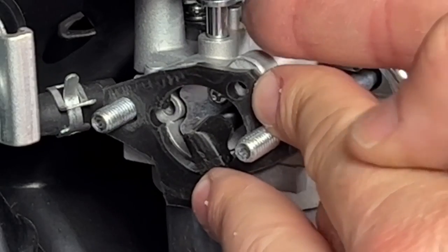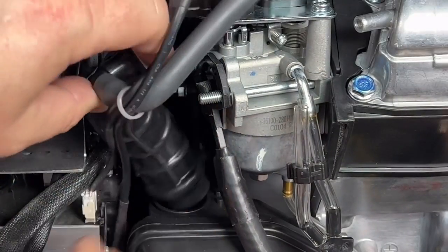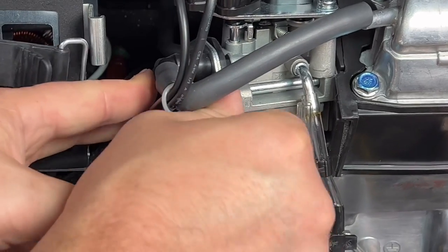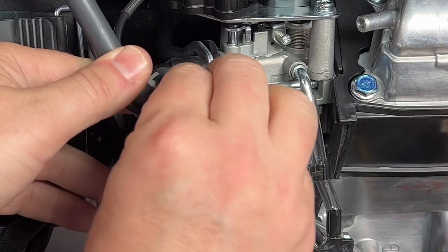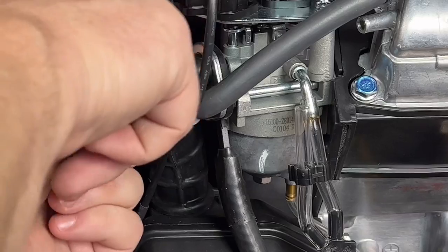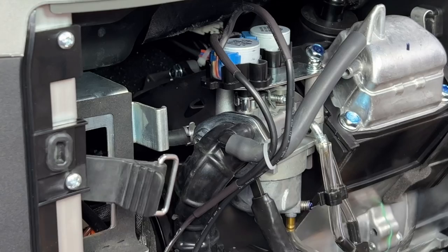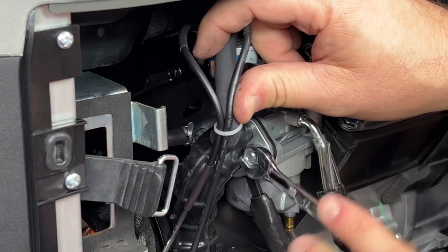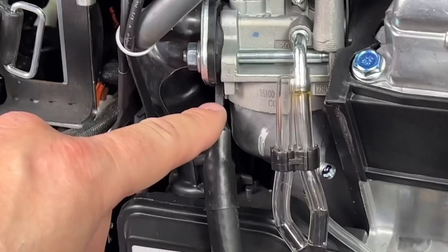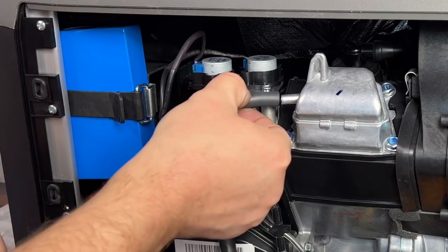The snorkel should function so the choke plate opens and closes automatically, allowing you to still use fuel or propane — the generator still acts normal. Reinstall the air intake tube and press it back onto the carburetor. Take both 10mm nuts and get them started, then tighten them down — don't overtighten, just get them snug. You want to squish the gasket but not squash it.